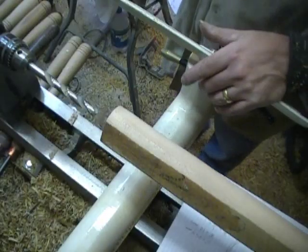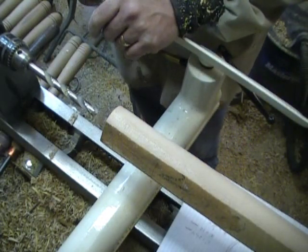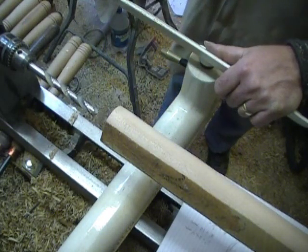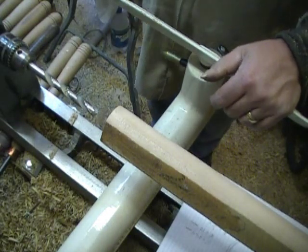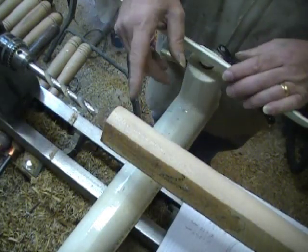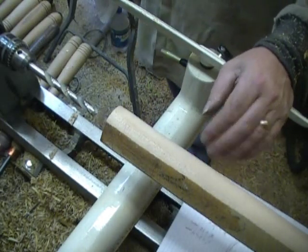I don't seem to have a 12 millimeter bit, so I've got a 15/32 bit mounted here. We'll see if it will give me a hole big enough. I'm just going to make a test hole first, and then we'll see. Then I'll try the tool in it, and if it won't go, I'll have to go to a 31/64 bit.